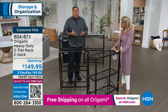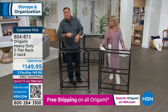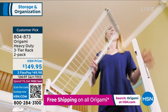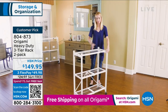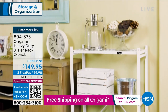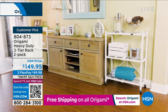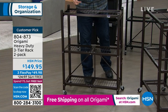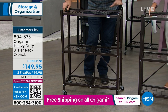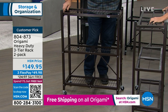Like all Origami, these are powder coated steel. A lot of people don't understand what powder coating is — it's not paint. When you paint something, you slap that paint on and wait for it to dry. When you powder coat a material, you actually attach electrodes to the metal, put an electrical charge through it, then spray it with the powder coated material. It looks like the metal's magnetized when they do it — you should look up a video on YouTube sometime, it's so cool. It wraps around everything, and if there are any voids or holes, it fills them in. That's how we can make the claim that these are corrosion resistant, because it's so completely covered. And unlike paint, which is fairly simple to scratch or chip, powder coating is scratch resistant and chip resistant.